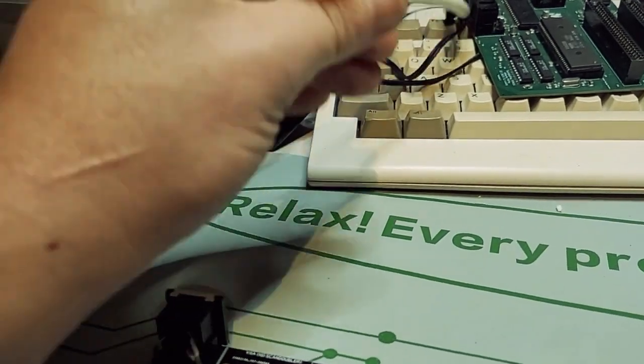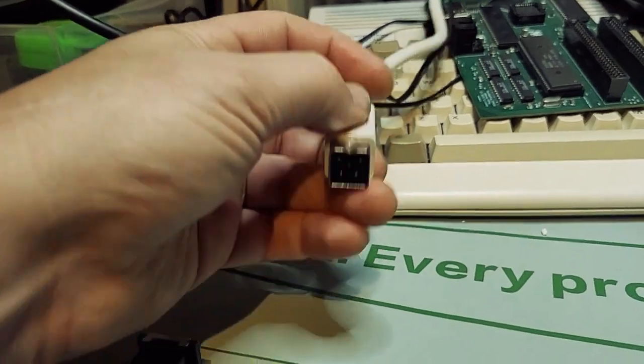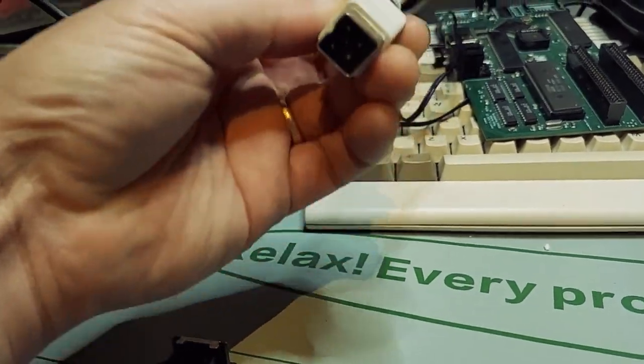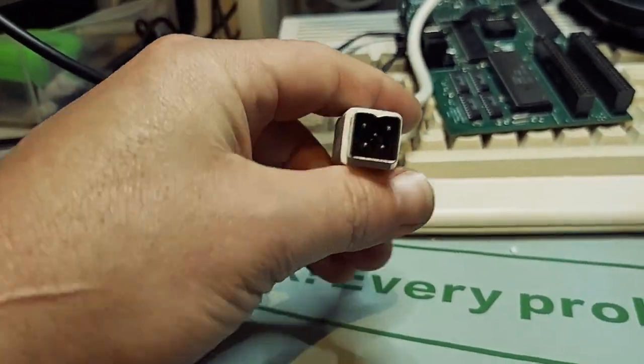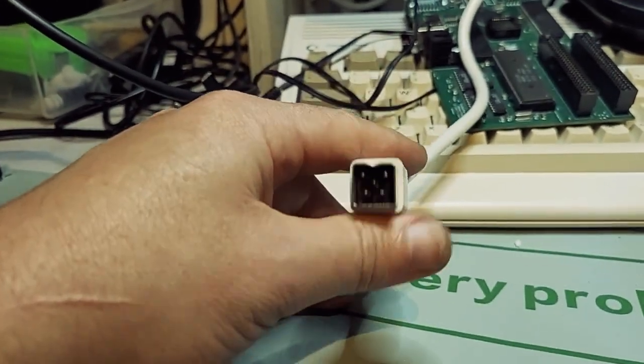I did some research a while back online, and it seems that with certain power supplies, that's the behavior when you measure them without load. Once they have a load, they behave normally. But it's interesting, some people get that, some people don't get that at all, and they actually get different results on their power supply. So I did read up a bit more, and indeed some of the cheaper ones. There were a few versions of the 1200 power supply, and there was a cost-reduced one that does indeed behave funny without any load, and I've seen people report the same behavior.